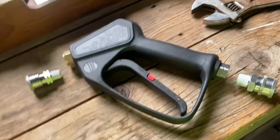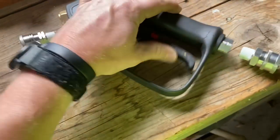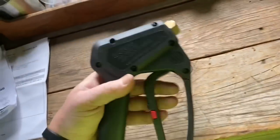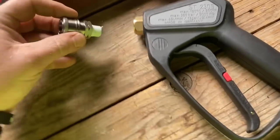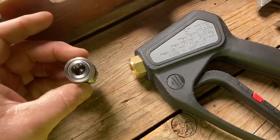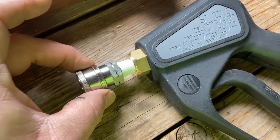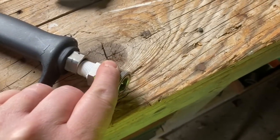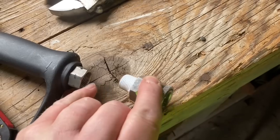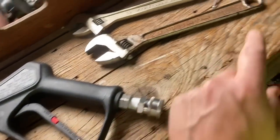Next we're building a little pistol gun — this is the Sutner ST-2305, also known as the Easy Pull. It's very light on the trigger and a nice lightweight gun. We're doing stainless steel fittings wherever possible. I never buy brass anymore — anything I buy going forward this year has all been stainless, much easier to replace. We'll get everything thread-taped, connect the nozzles right there, and have a short gun. I'm probably going to add an additional Mosmatic swivel like I have on my other gun because I don't do a lot of back and forth with the ball valve when I'm just downstreaming.